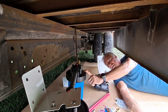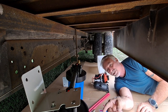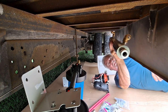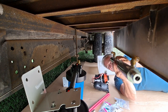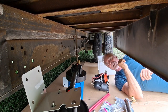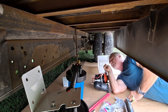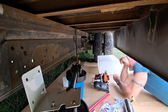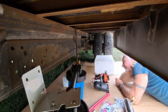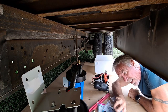From the accumulator it goes through my first five-micron filter, then through my five-micron charcoal filter. Then it comes back around to my UV light — that's my final defense. From there it'll go up into the floor and into the water heater, which will be mounted in the shower. The drain will come out, cross over, and go into the top of this tank. This is going to be a drain so I can drain it out into a garden hose, and this will be the fill and the vent.